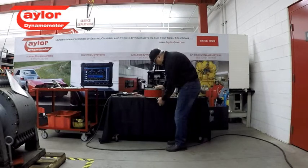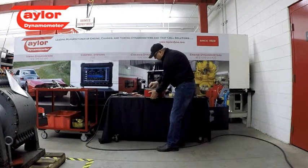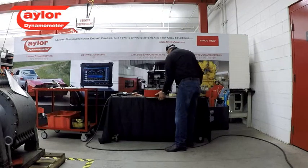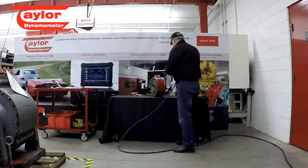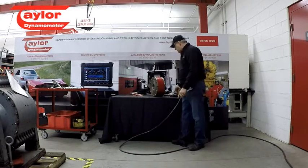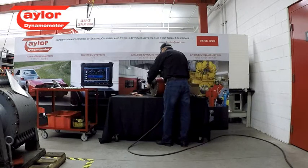Everything seems to be lined up pretty good. We're going to grab the hardware from the coupling and bolt the thing back together. Make sure you use your lock washers — I would recommend using new lock washers, though you do not get those in the kit from Taylor. We've got all the bolts and hardware installed, and we just need to torque everything up. I prefer to use an impact on it. When you torque it up, do a crisscross pattern because you are squeezing everything together — that ensures you pull it in evenly and don't have any wobble.